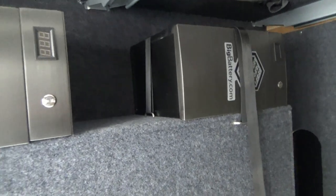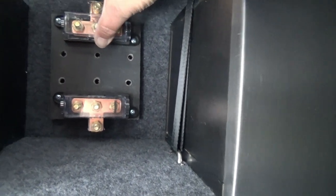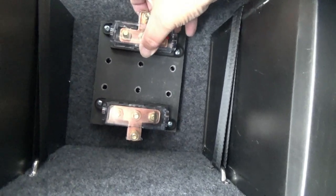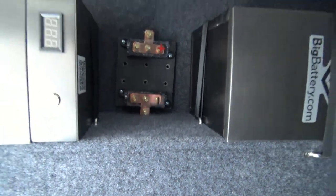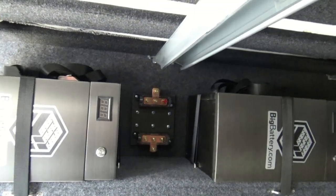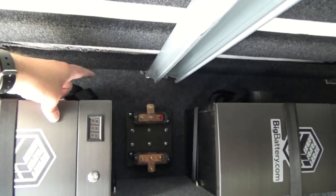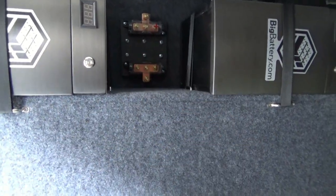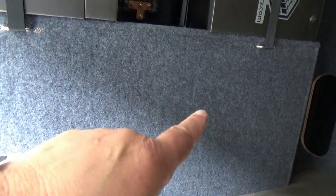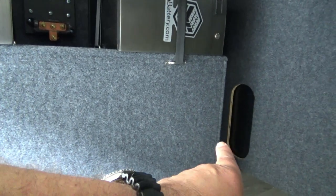Next step is to install a parallel bus bar. I'm going to install that right in between the batteries — positive on top, negative on the bottom. Then we can run wires out from here, probably to a couple of bus bars, and start distributing power. Once my other parts come, I can get the connectors — black and red — connected. I think I'm going to go ahead and stick the inverter in place, then fuse blocks, and figure out where I want the DC to DC charger.